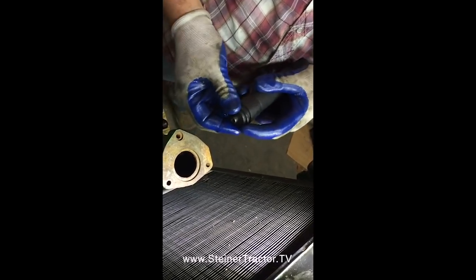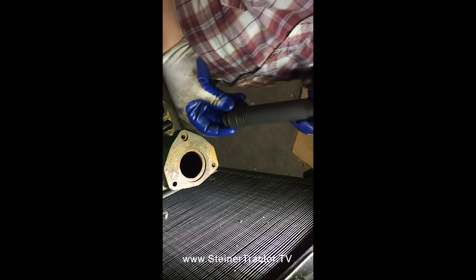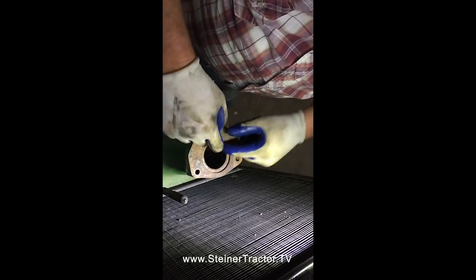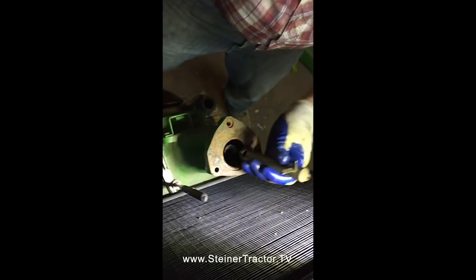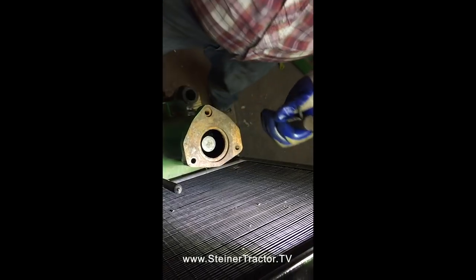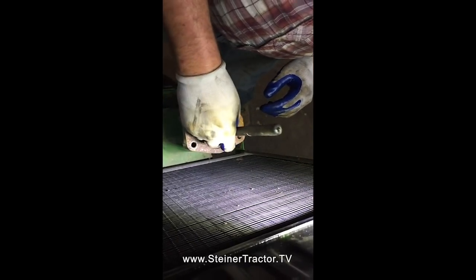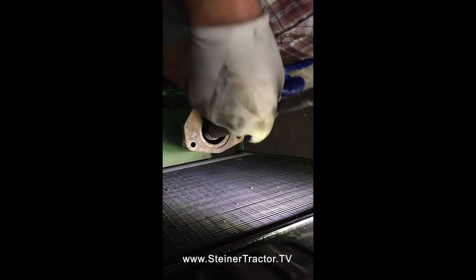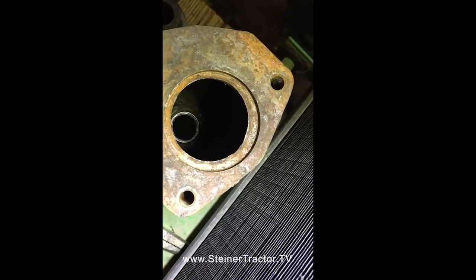And you notice I've lubed everything up. So the idea is this goes inside of our bushing, pulls it down, lines everything up, and then I'll be able to drive our seal in very carefully. Feel like everything is lined up good in this case. There we have it. Our top seal is installed. See if we can zoom in on that.